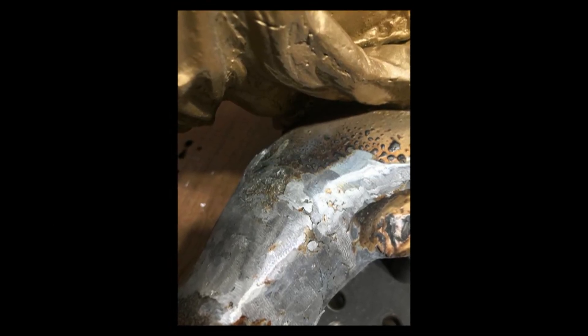When working with Super Alloy 1 on large white metal projects, you may need to use an old butter knife, a flathead screwdriver, or a stainless steel spatula, as Mark and the guys are here, to shape and contour. They poured some flux on a plate, used a spatula to grab the flux, then heated the back of the spatula while shaping.